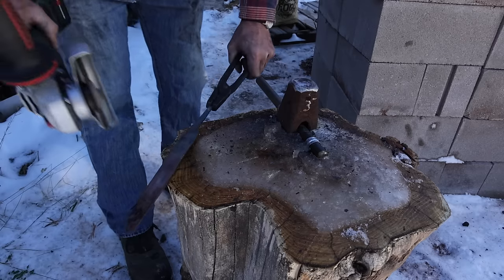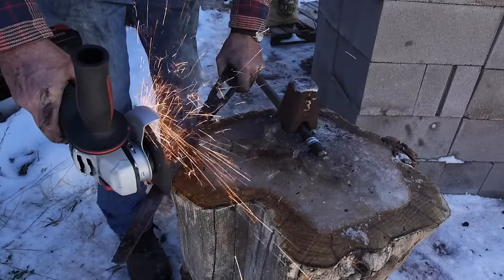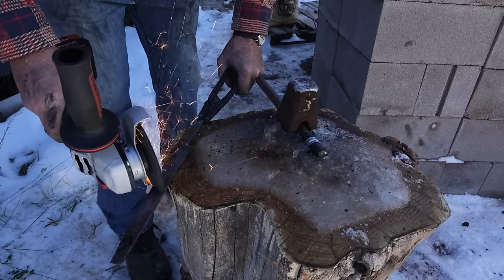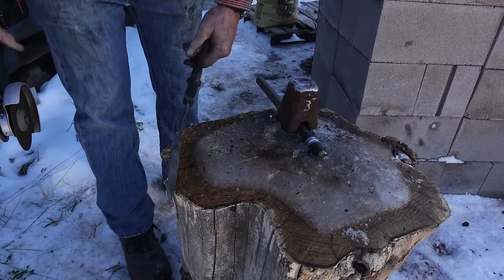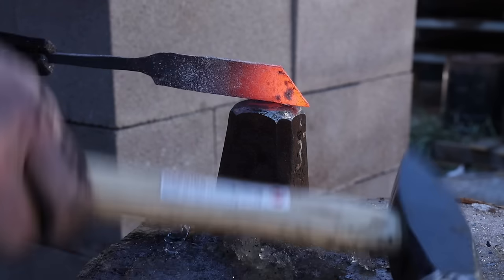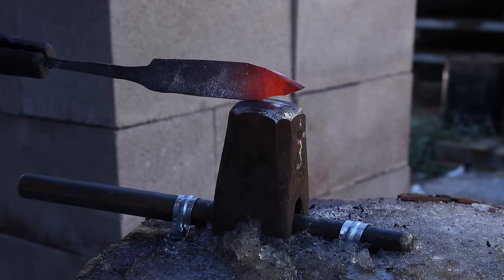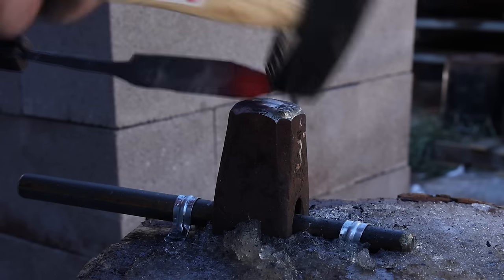I don't want to use this whole file for this knife — that's just way too long. So I'm going to go ahead and cut the end of this off using an angle grinder and a cutoff disc. When I do this, I angle it towards the back of a blade, and that way when I forge this all out and the point bends up towards the back to straighten that out, I end up with the original steel across the cutting edge as opposed to the cut I just made. I theorize that keeping that steel straight and intact along the cutting edge probably improves it.